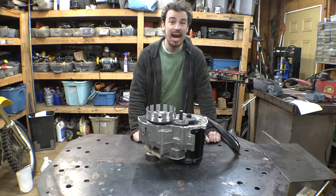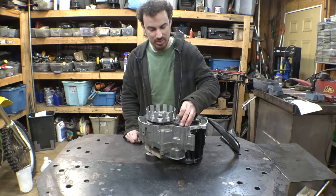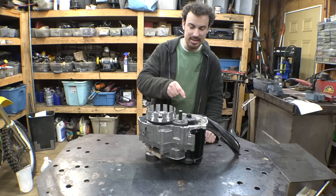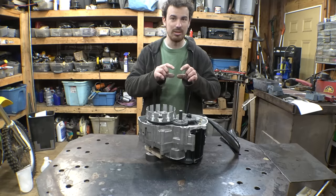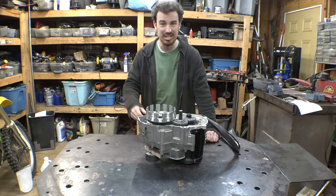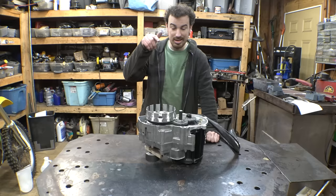So anyway, next video, we get to finalize the exact position of this gear. We need to figure out exactly where it needs to go and then drill the hole. I do need to figure out how much backlash to put in these gears, because you don't want to just mash the gears together. You do need to allow for a little bit of clearance for the oil and for expansion and all that kind of stuff. So we just need to figure out how much backlash to put in these things. Then we can drill the hole and everything.